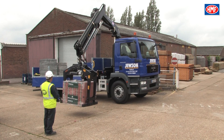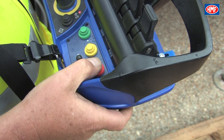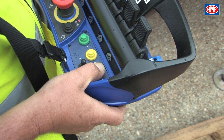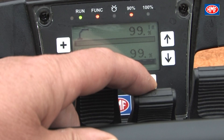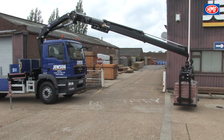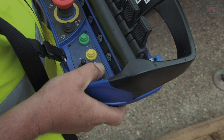When this occurs, firstly try to bring the load in towards the vehicle to reduce the lifting moment. If the crane is locked out to the extent that all functions are locked out, the red button on the chest pack can be pressed as an override facility. This will offer 5 seconds of use whilst holding down the red button to reduce the load moment or increase the stability of the vehicle. If the crane hasn't reduced the load moment or increased the stability sufficiently in this time, the system will remain locked out for a further 30 seconds until the red button can be held down again for another 5 seconds of use.